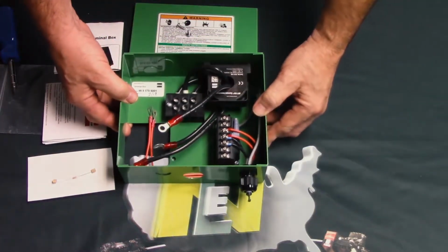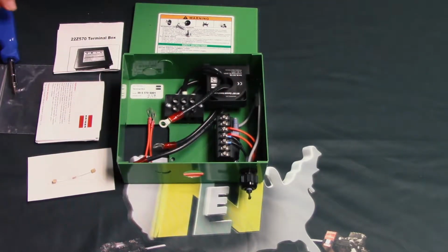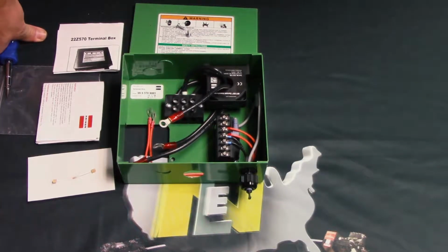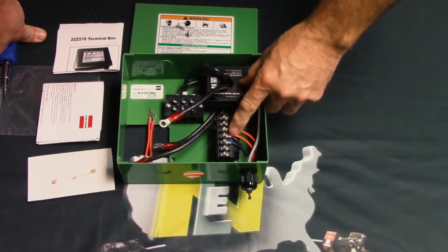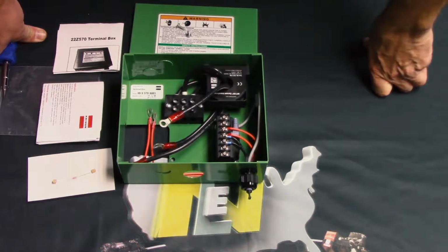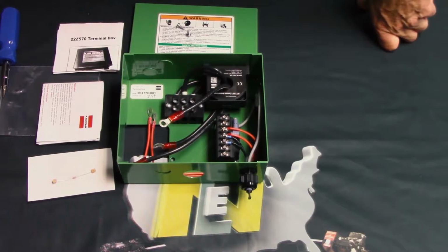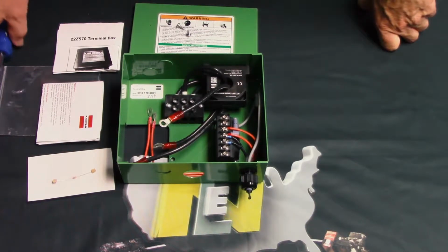The next step is the small wire configuration changes that are on this control here before we can do anything. One of the most important things you need to know before you wire this is the compressor it's going on, whether it has PTCs, which is a positive temperature coefficient reader within the compressor, a thermistor, or if it just has a bimetallic thermostat. So we're going to assume for the current instance that you don't have a PTC, that you have a bimetallic thermostat, which a lot of them have right now.